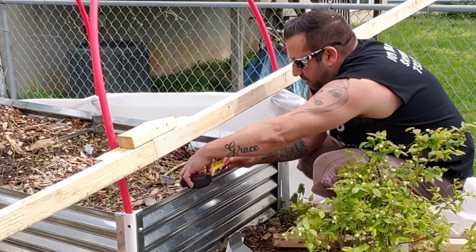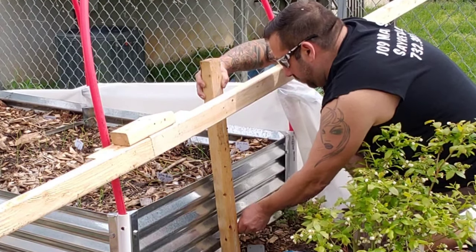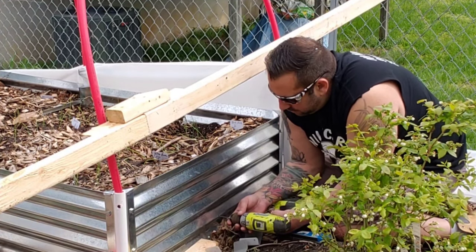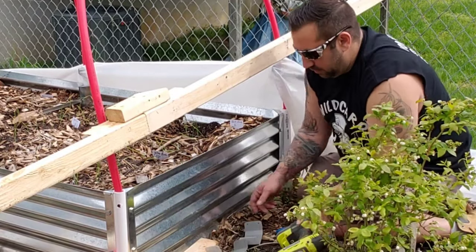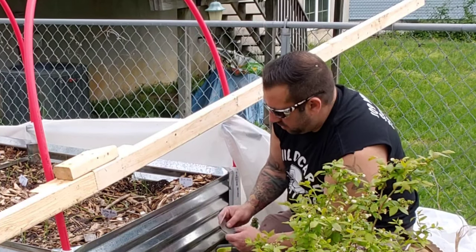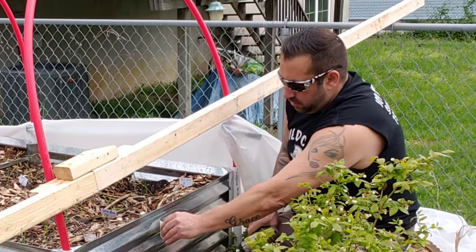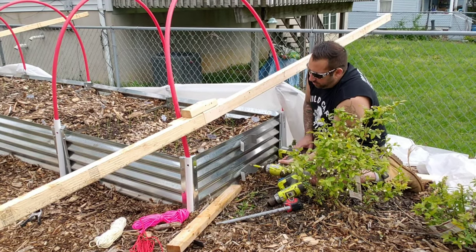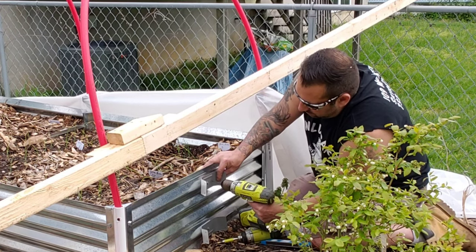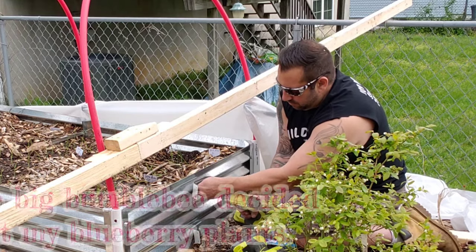It's 40 inches wide, so my middle mark is going to be at 20. I have these little half-inch machine screws that are supposed to be self-tapping, but they didn't want to self-tap with this metal bed, so I just pre-drill it. These are just gutter brackets — what you use to secure rain gutters from your house. I'm going to put in an additional two holes.